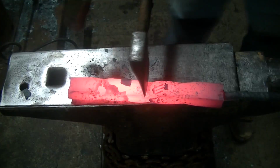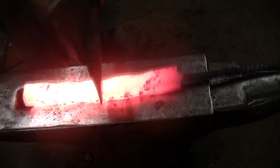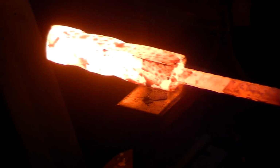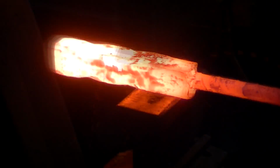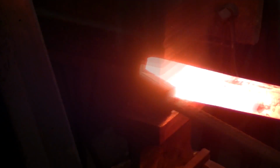I didn't want to do this on the hot cut. And it's a little bit long, and the handle was a little bit flexible. So it took a couple of heats, but we got through it. I welded a handle on each one and went for it. And we're going to take these things down to about 3/4 inch thick and 1.25 inches wide. So I built myself another kiss block at 1.25 inches. Dress those things up.